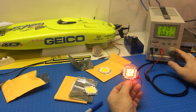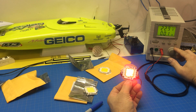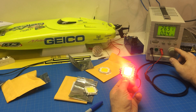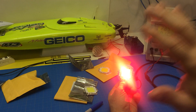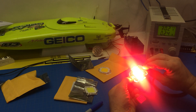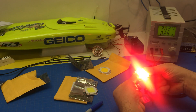You can see more and more lighting up. What I have to do is keep an eye on the current — that's what's important. I don't know how much voltage or current it's supposed to get, so I'm going to err on the side of caution and keep it low. Plus I know these will get really hot and right now it's not. It's starting to get really bright though — it's starting to blind me. Alright, don't look right at it. It'll give you a headache. I'm not going to take it past 30 volts. It's only at 0.2 amps and it's starting to get warm but not hot.